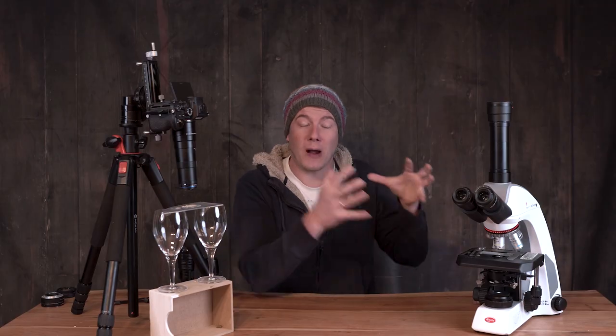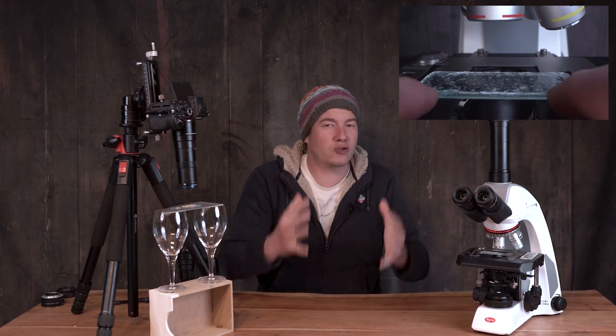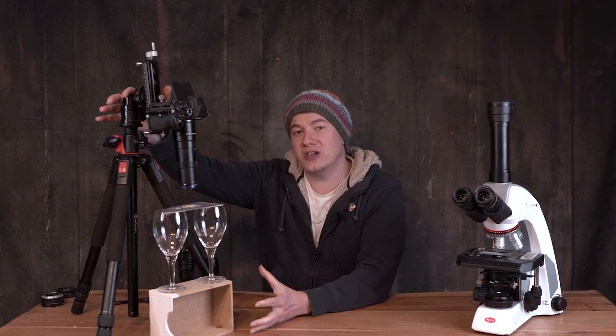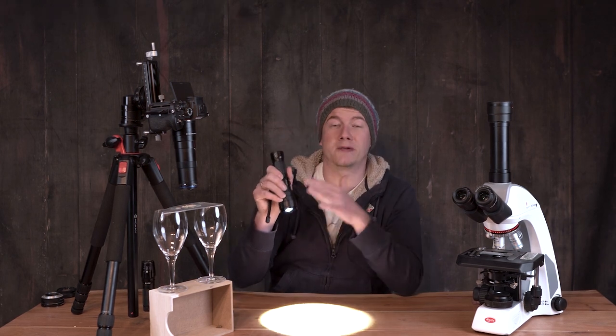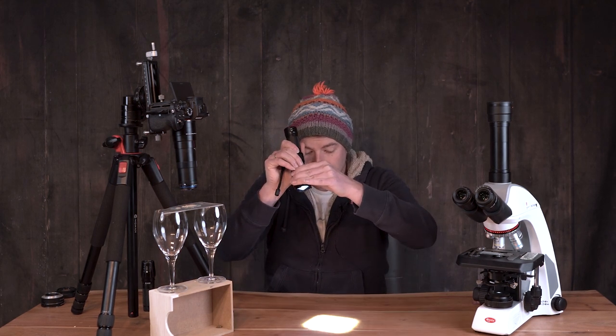The next very important component of a microscope is actually the illumination system. It is very powerful and can be focused on a point so that the illumination is extremely strong, like we'd have with a flash but with continuous light. The solution for our DIY microscope is actually pretty simple — you just need an LED torch with a zoom function. Those LED torches cost between 10 and 30 Euro, and since the light source can be focused, it's a quite simple and cheap fix.